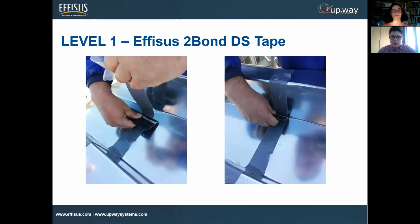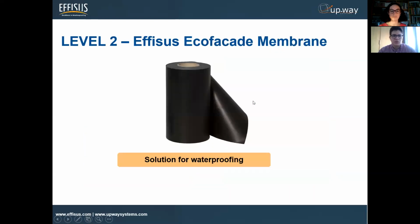and then you go confirming around the corners you see there. So you're just pressing down around there. In this case, we went all the way up, and not only in this part, but over there too, because we need to seal the whole connection, the whole joint. In this case, we even have a fastener, a sort of screw here. It's quite interesting because we even use this specific tape to seal details like screws or fasteners. So you can also do that, and we even recommend it. You can extend over and cover the perforations as well.